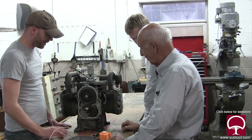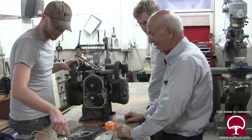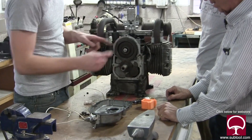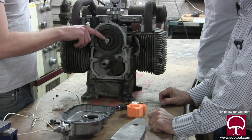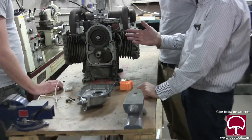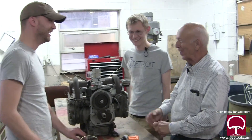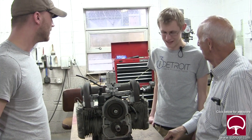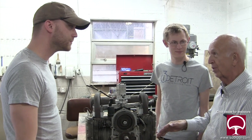In order to do port injection, I needed more resolution on timing. So I've got these gear teeth sensors, and I machined some blocks inside the cam cover. One actually reads off the teeth on the cam gear, and the other one gets absolute position off this set screw here. Are you an engineer? Yes, I am. Well, that's starting to make some sense now. What a breeding ground this place is — the fact that you have all this at your fingertips is pretty cool.